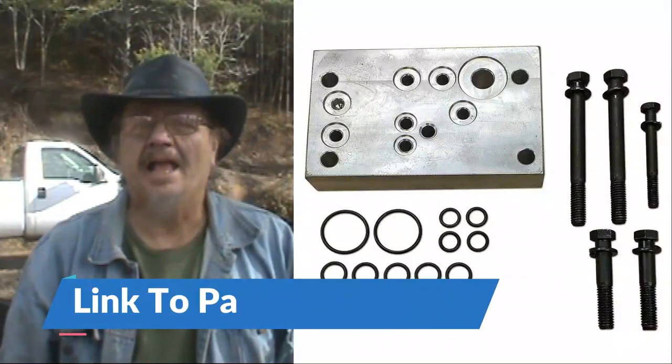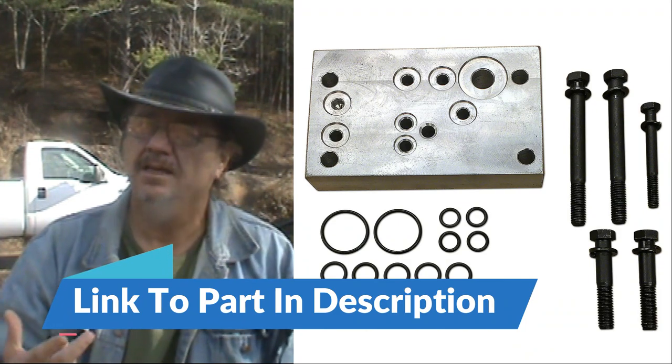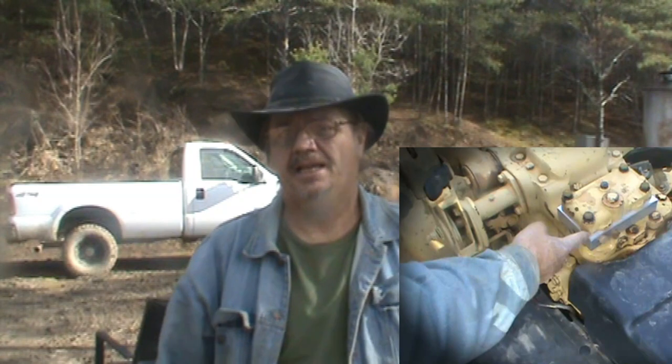While I had it apart, I wanted to put in remote hydraulics - I'll insert a picture right here to show you the hydraulic part I put on. I've already mounted the plate, and the way this plate is supposed to work is hydraulic pressure goes through the plate, out through the pressure side port, through another hand valve, back into the tank side port, and then it activates the blade arms. So stick around and we'll see if I can figure this stuff out.